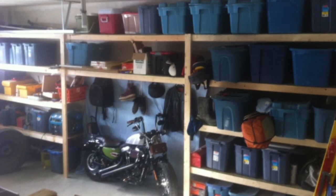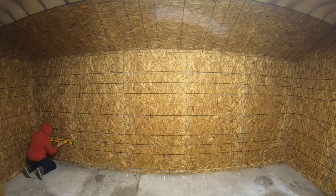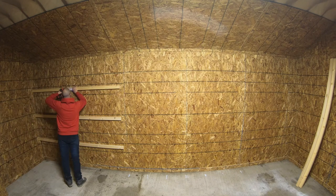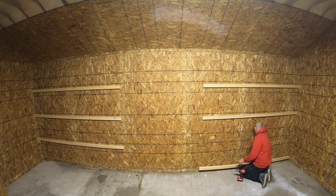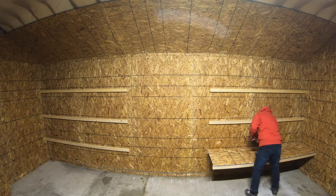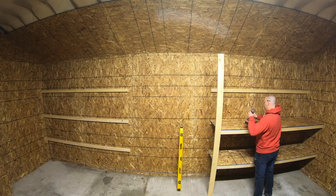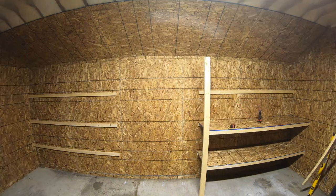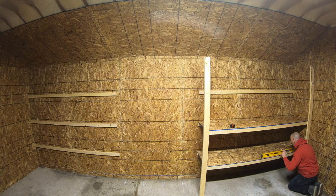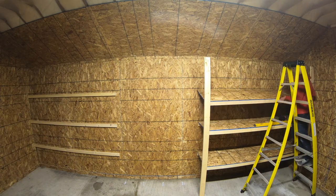In this garage I got one extra shelf because the ceiling height is 10 feet. With the studs marked on the floor I can easily screw the 2 by 3s to the studs with 3-inch wood screws. I'm putting my two 8-foot sections to the outside and leaving the filler strip for the inside — you can go 8, 8, 6 or 8, 6, 8, whatever works for your design. Once the ledger is attached, bring in the shelf, screw it to the ledger, use your level to make sure it's perfect, then screw to your front support and move to the next shelf.